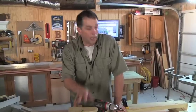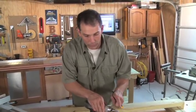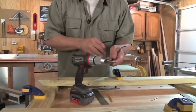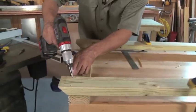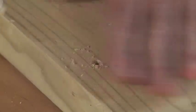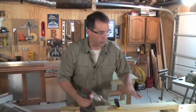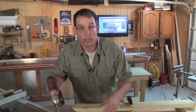I've drilled all the pilot holes for the long side. Now let's talk about this countersink bit — this will just make a little seat for the head of the screw, keep us from splintering those wood fibers, make things look a little bit nicer. You just pop it in the hole right there and just give it a quick burst. These run about thirty to forty dollars for a good one but it's a great one to have in your toolbox. I'm going to finish prepping the rest of these holes and then we'll put the table together.